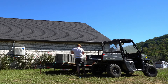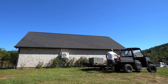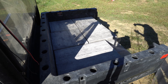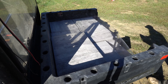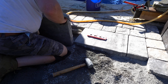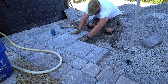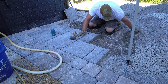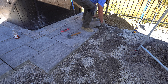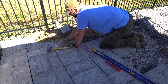The next few days were long and tiring. I loaded and moved every paver for this patio from one side of the house to the other, then placed each one, all while fighting this number 10 gravel that for some reason ended up having a lot of much larger gravel mixed in. In retrospect, I absolutely should have used sand. It would have made it way easier and faster. But the number 10s were on sale at the quarry and the installation instructions for the big pavers said it was an acceptable material.